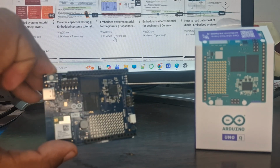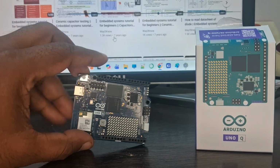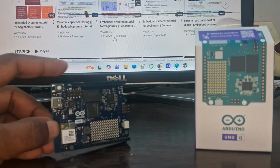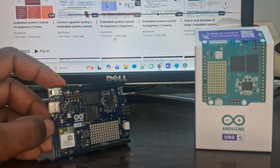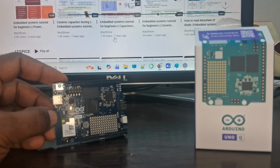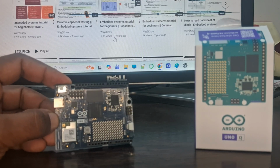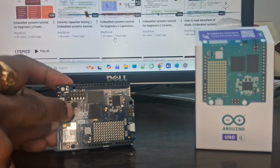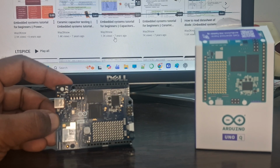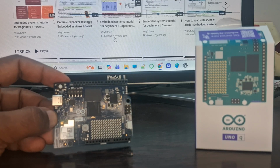the USB Type-C. On all the boards in the current market where they use USB Type-C, this particular board, apart from the power and the USB signals, has display signals that are routed over the USB. For this, there is a bridge here. You can see here. The MIPI DSI signals are converted into USB signals by that particular bridge, and you have the display signals connected out.